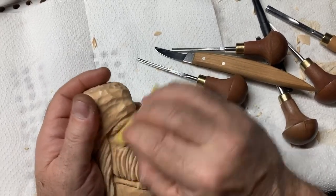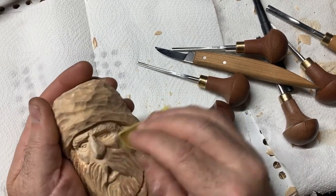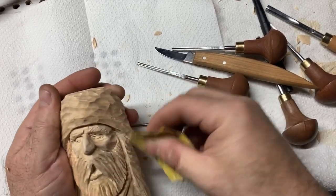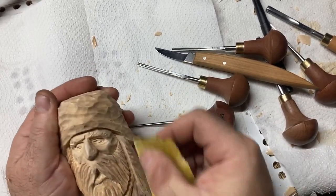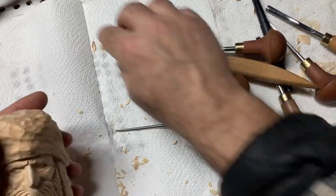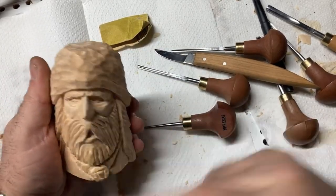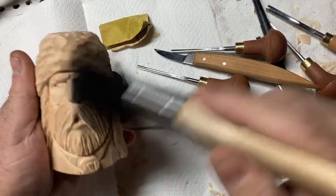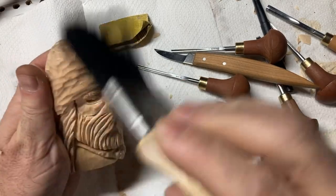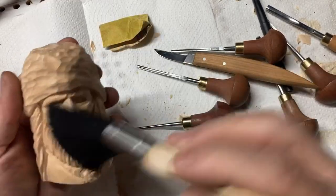You got any knife carvers out there, they're gonna tell you you're cheating, whatever. Don't worry about it. Clean them up. Like I said, almost with hand tools, almost every cut should be pretty much a finished cut for the most part. If you are going to work on them more after you sand it a little bit, I recommend getting a brush, because that will dull your tools in a second, running your knife or a gouge through that. So make sure you get the grit from the sandpaper off your carving before you continue on. All right.